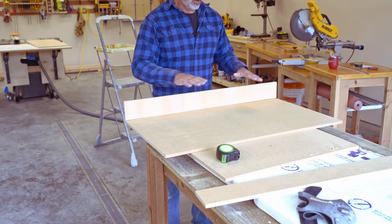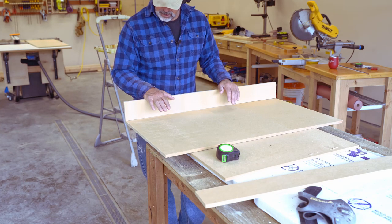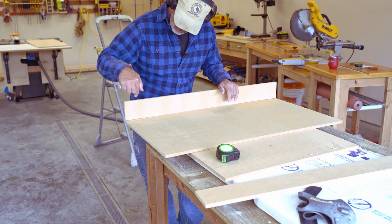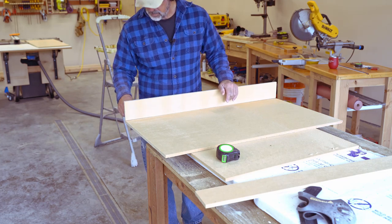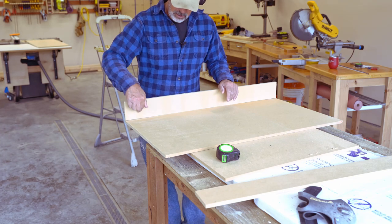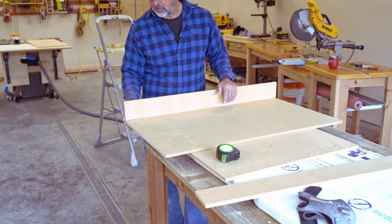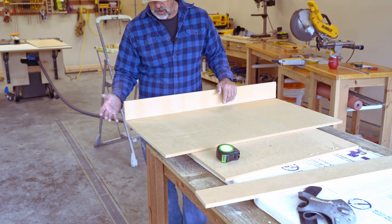The top will serve as the grooming table itself. One of the problems with putting this together — I want to use pocket holes, which would work on the inside here. But you really don't want the pocket holes going in that direction; it will break through the MDF. So what I'm going to do is come in from behind, and that way I can get to all the screws. If you do it on the inside you can get the bottom ones but you won't be able to get the top ones — not enough room. So I'll do it on the outside and then figure out how I want to cover that up.